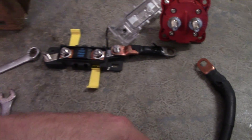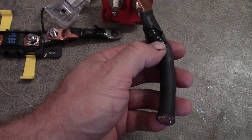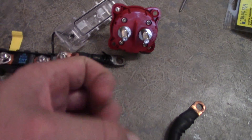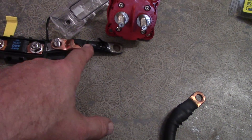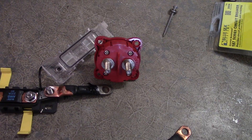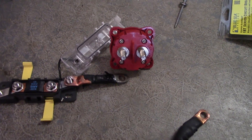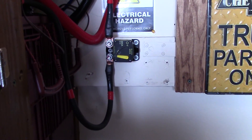I'll be honest — I should have tightened that and cranked the snot out of it. On the output of the switch, the heat shrink was coming off. I took my laser temperature sensor and was getting all kinds of heat built up right around the switch. Resistance produces heat, and that's no bueno. So I took all this crap out and just simplified it with the circuit breaker.